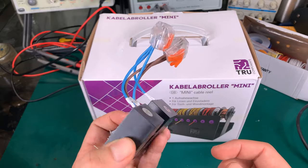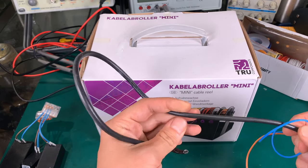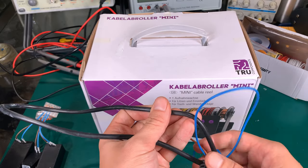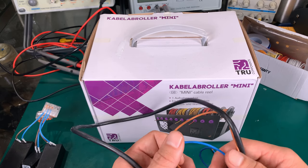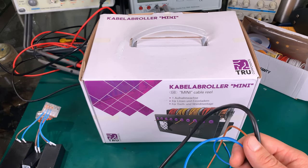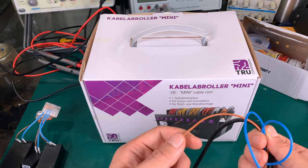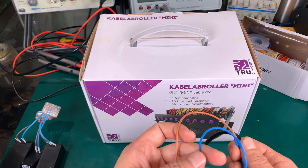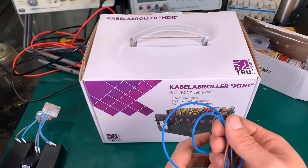In general, when I'm doing my own projects, as you can see, I'm reusing old cables. I grab a cable — this was an old power cable — I split it open and I'm just taking out the wires. I've got a lot of power cables and they are absolutely great, but they are color coded for AC voltage. For many applications that's 100% okay, because it's quite easy to understand that brown, which is live, is going to be DC positive, and blue, which is neutral, is going to be negative. That's a smart approach and I've got no problem doing that.